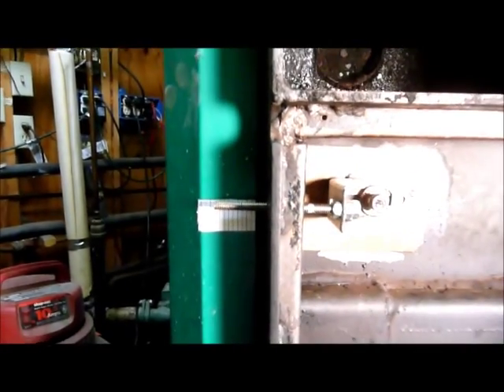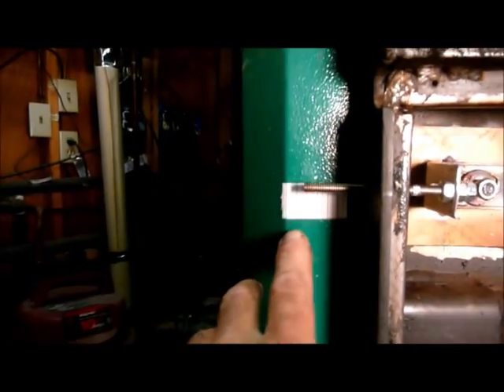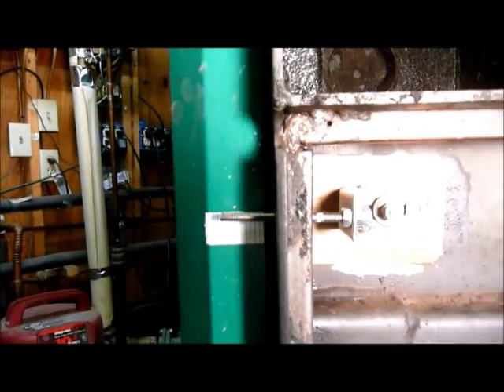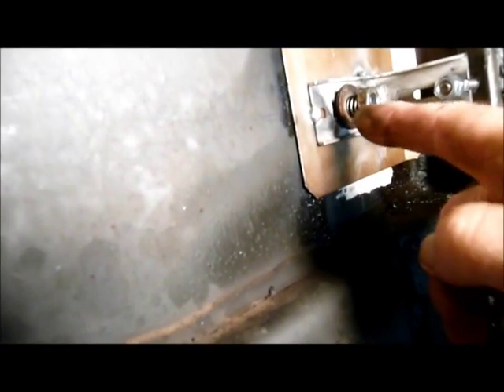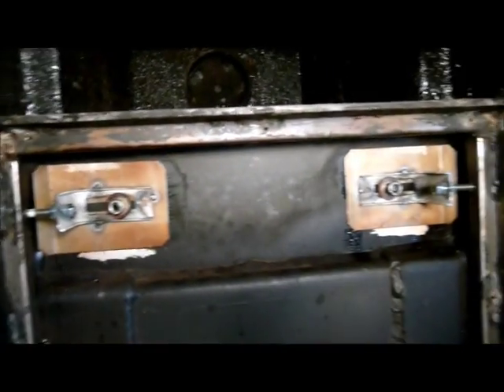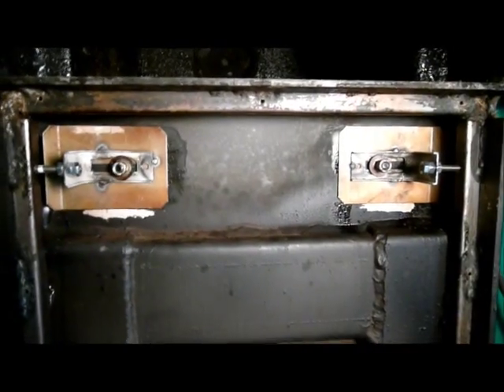To keep track of what I'm doing, I've mounted a little gradient on the side of the stove right here. Each mark is an eighth of an inch, so I can do really fine adjustments and keep track of what I'm doing. It's not going to move — once I set it, it stays. I did put a little spring on top of the washer just to hold it in place, and used a little Loctite to make sure that nut doesn't back off. I think I'm going to like being able to change the amount of air on the fly without having to shut the stove down.